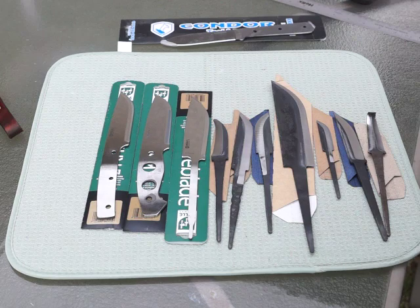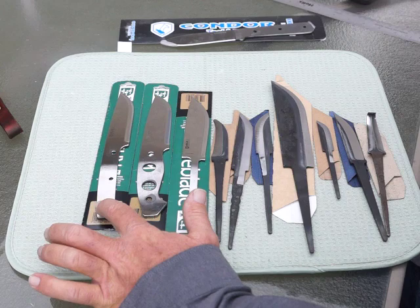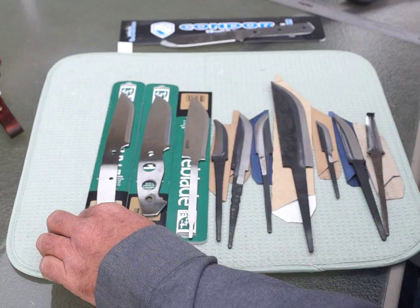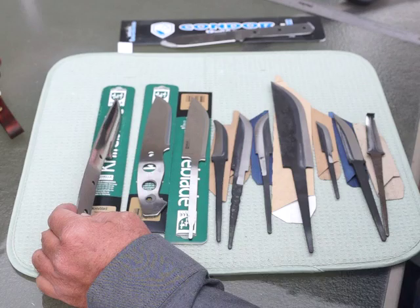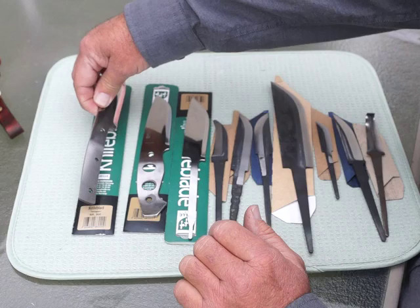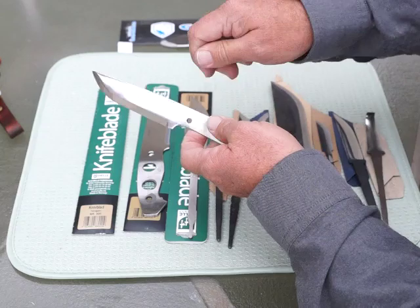Overall, my favorite knife brand for knife blanks is Heli. They come in two basic types, well really three different steels. The vast majority of the Helis are a laminated steel — stainless steel over a high carbon steel center. What some people would call San Mai, they call triple laminated steel. This is a model 300. There's another variant that's hard to get called the 301, where it's laminated carbon steel over carbon steel. The biggest thing with that is it throws better sparks if you're making a survival knife and using a ferrocerium rod on it.